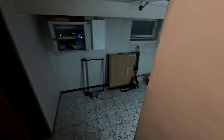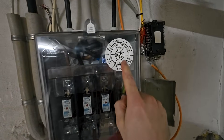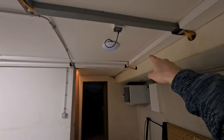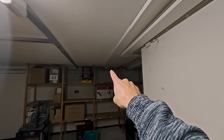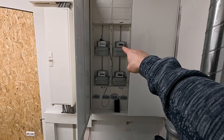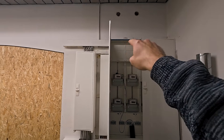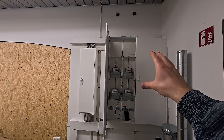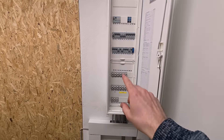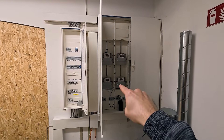In the basement, the building is hooked up to three-phase power right here — what looks to be three-phase 100 amps. From there it routes up into this cable channel, goes along this cable channel to this wall and then up. In here it then goes into this cabinet and splits up into the four meters, because in this building are four businesses. Our main fuses are 35 amps, three-phase each — that's how much we get, and that's actually how much everybody gets: 35 amps, three-phase.